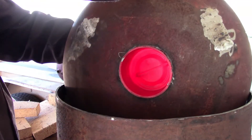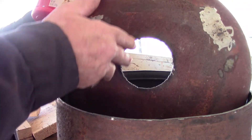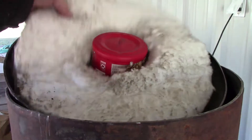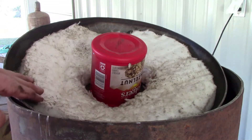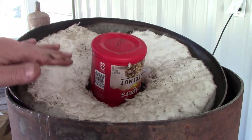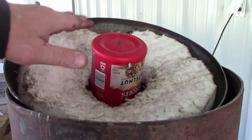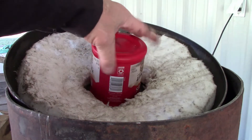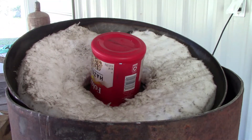What I did right here is I used a coffee can to mark where I wanted my hole in the center of the lid. The reason I wanted it that size is I'm going to use some of this insulating blanket — you see almost everybody uses this in their furnace. I'm also going to put at least three-quarters of an inch of castable foundry cement in here with some reinforcement wire to help support it and make the span. I want to leave a ring, so this can will make a nice round symmetrical hole — when I take it out it'll be a nice clean opening for the top.